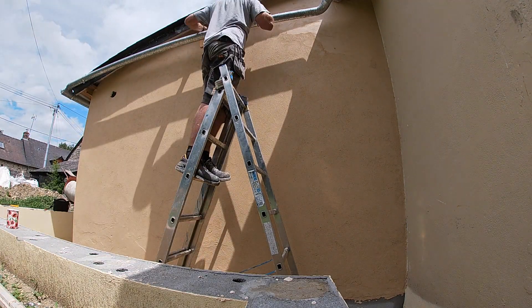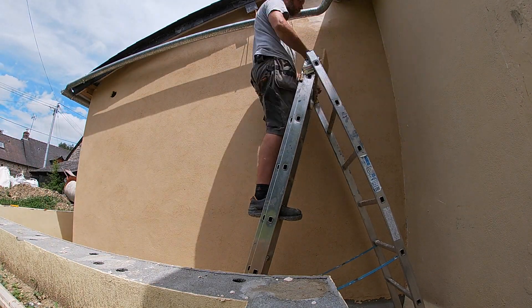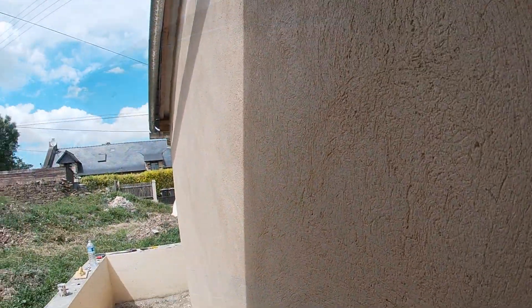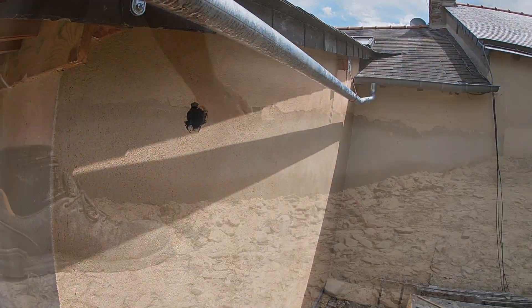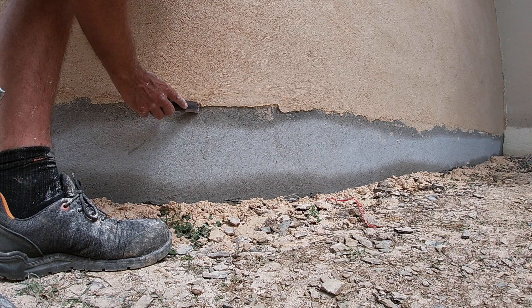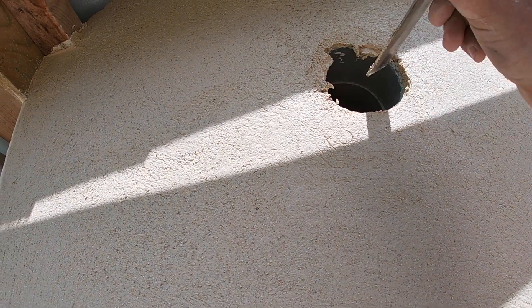Just carry on with that. If you find some parts of the wall haven't gone off as much as the others — the bottom right hasn't gone off yet — do all the rest first and come back to it. It could be because it's in the shade or a slightly wet mix. This is your final finish: textured but flat. All I've got to do now is trim off the bottom bit so it meets the old sand and cement render, using a wire brush and scraper to get it to the right height, then clear out the fan duct.